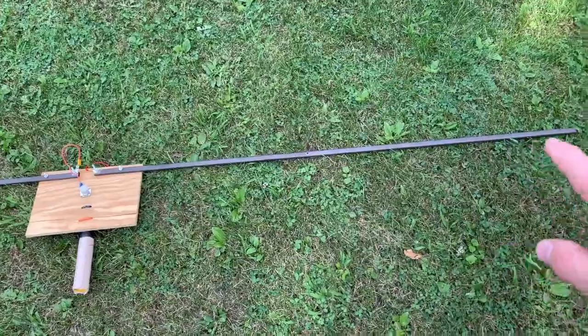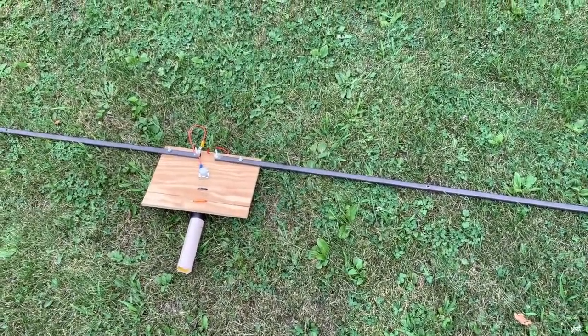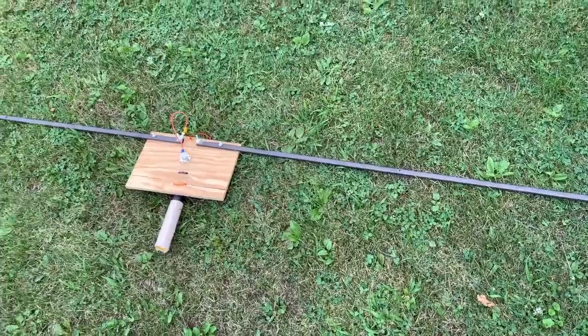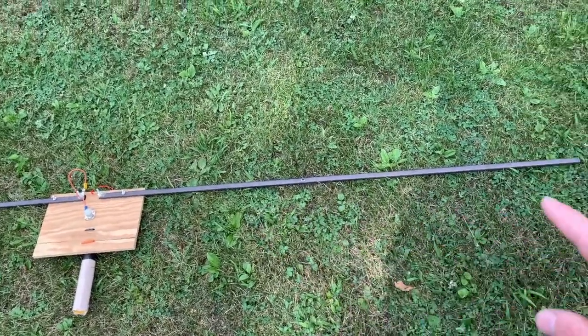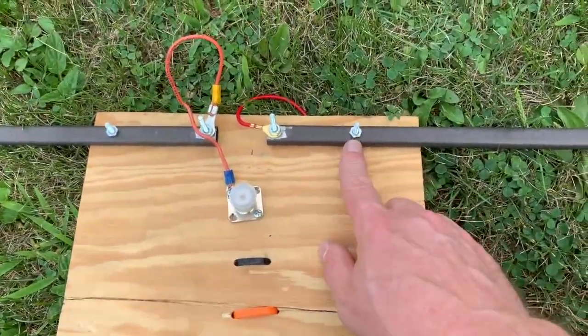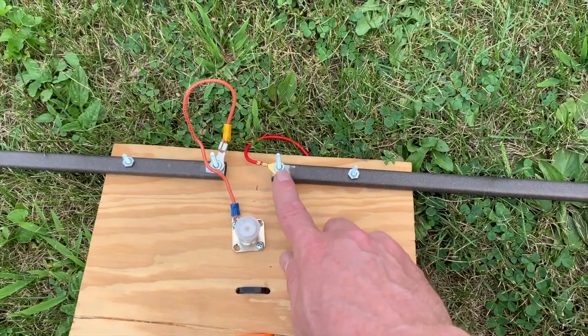So I took apart the umbrella and began to assemble things. I started off with the long arms from the umbrella. I did the math — 468 divided by the frequency I wanted — and when I worked it all out, the whole thing needed to be almost 10 feet long. It's an eight foot umbrella, so what I did was drill an extra hole right here and used my Dremel to sand off a good connecting point.